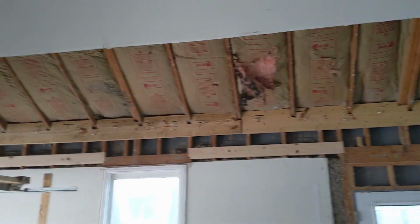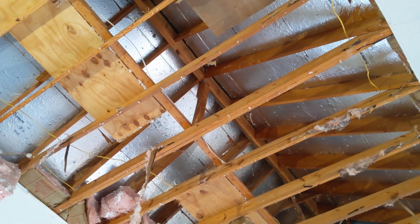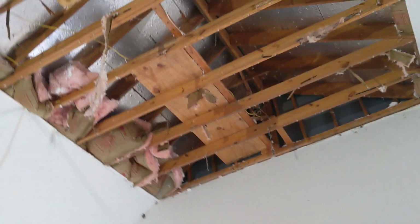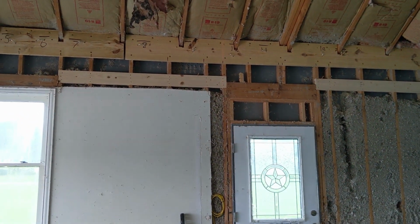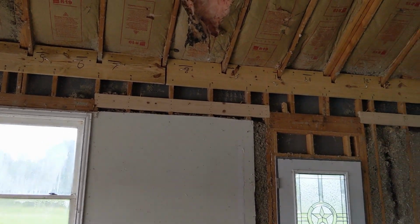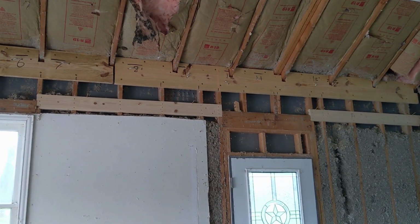But we're not just going to be pulling, we're also going to be pushing on the ridge beam up there. So we have a few 12-ton and 20-ton jacks, and we're going to build some posts and jack up the ridge beam while we are pulling in the walls. Now thankfully the bricks outside, it's just the top bricks that have pushed out because of the design. Those vertical bricks have kind of saved that whole brick wall, because if they'd been laid horizontally like the rest of the bricks out there, the whole wall would be pushed over. But it created a nice break so that this wall has been pushing against those top bricks, and only the top bricks are really pushed out of level.